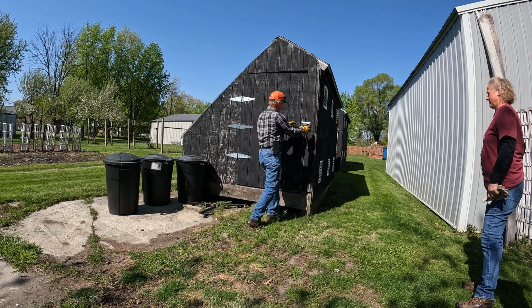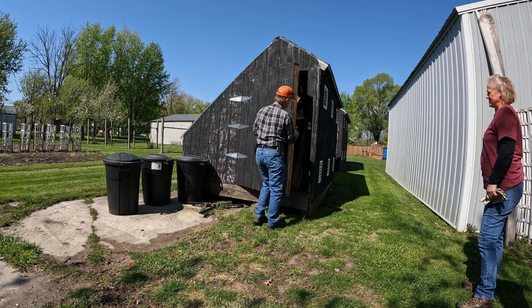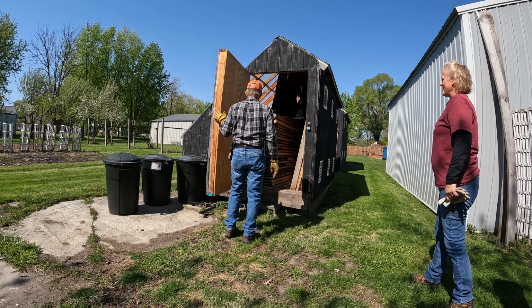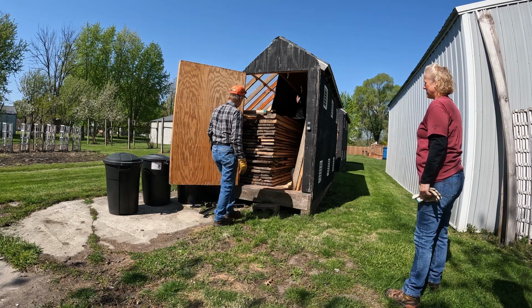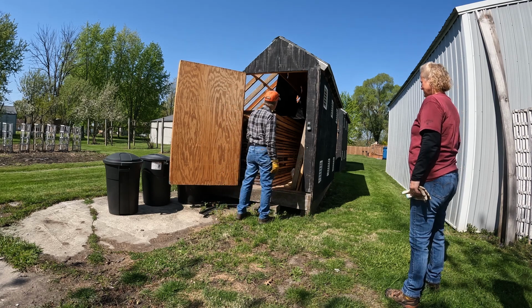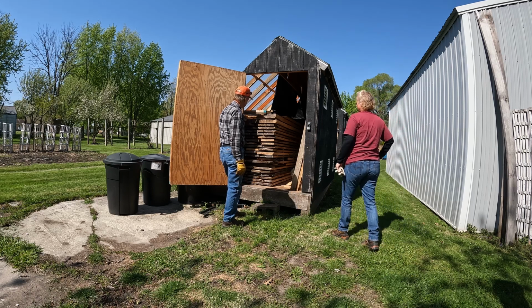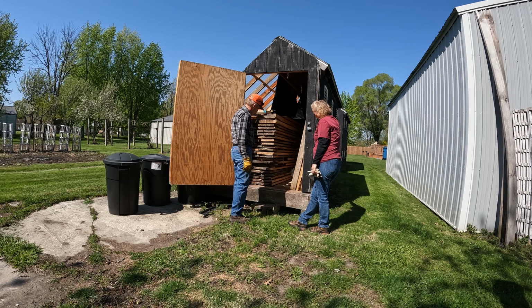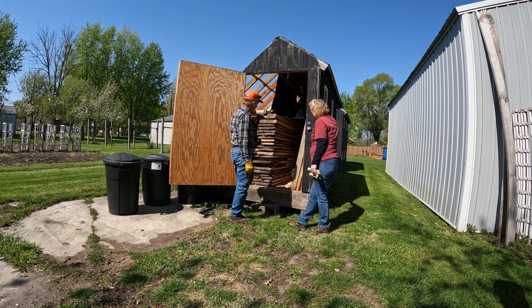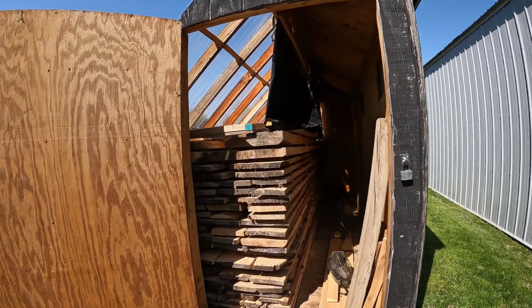See what's in the solar kiln. That would be maple. You tested it? Yep, he is done with it. It is done, ready. 7% moisture content. Held for a week and ready to go. 2-inch, 2-inch, and the rest is all 4/4. She's ready to go. So this is just your basic Virginia Tech solar kiln.